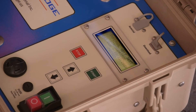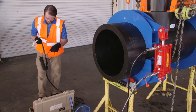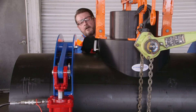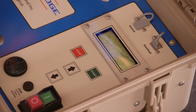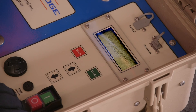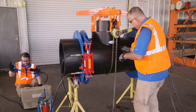Now it's time to fuse the saddle. The electrofusion processor's leads connect to the fitting. The barcode on the fitting will communicate the fusion parameters to the fusion processor. The processor will fuse the fitting for the time listed on the coupler's label. Cool time post fusion is also listed on the label. Use a feeler gauge to check for gaps in the completed fusion.